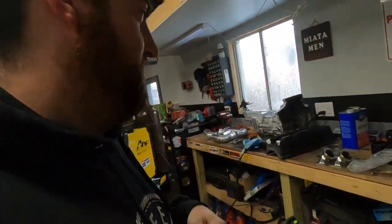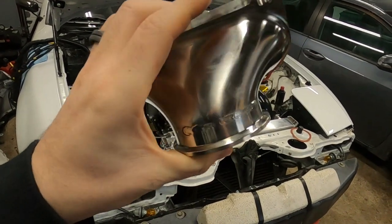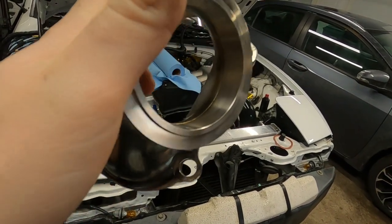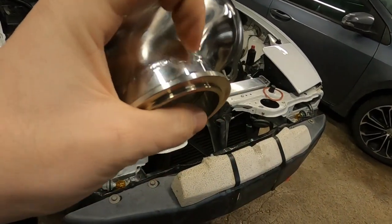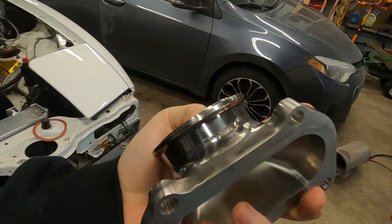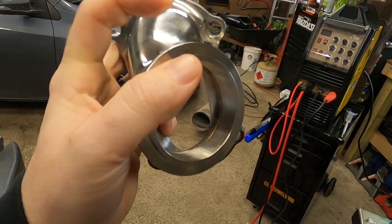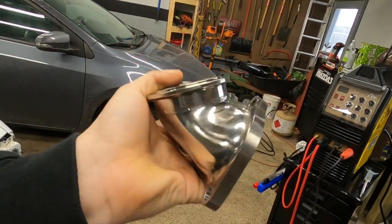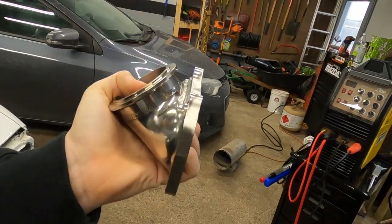The turbo manifold also got welded up. You can see we polished it all out so the heat colors are gone, but it's a really solid piece. Before anyone calls it out — you can see there is technically no penetration. This lip inside is a step out from the pipe, so you wouldn't get penetration anyways because it's not a straight shot. The point of that ring is that it centers the V-band and takes the load on top of the weld, so there's really double holding force and that weld's not gonna crack. Super stout.